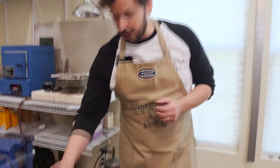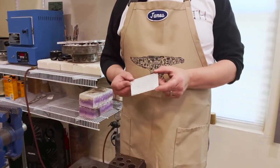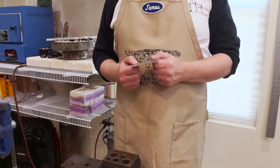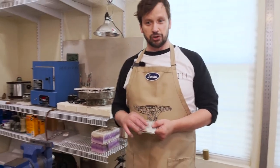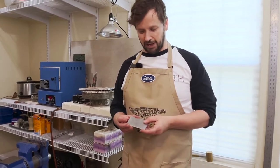What I have here is 18 gauge aluminum and it is not annealed. A common misconception is that softer metals will cut better, which is not true. So if you do need to anneal your discs for something else, you want to do that after you cut them out. When they're annealed they don't tend to cut as cleanly — they get more of a burr and kind of drag as they're being cut.